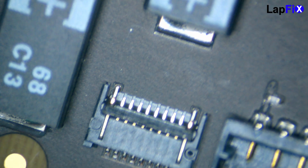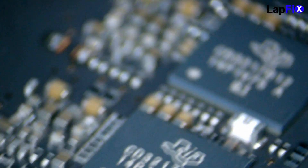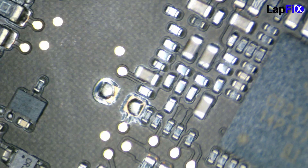Let's do a scan, starting with the obvious area. Everything on this board is more centralized — it's an ARM chip, so you've got SSD, CPU, GPU all in one. I'm always curious to see under here for any spot of corrosion. These are your CD3217B12s, right next to where the port is — they regulate voltage and do a lot of different things. If you're getting around 5 volts, that's usually one of the concerns. No obvious liquid spill, no obvious damaged components. Looks to be very clean.